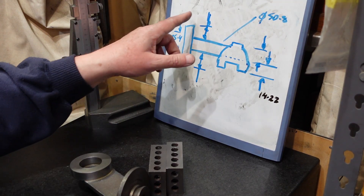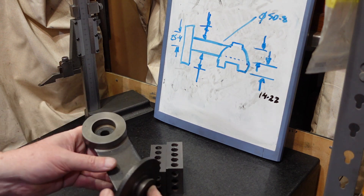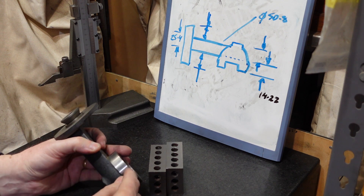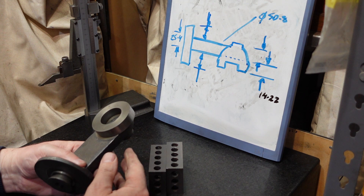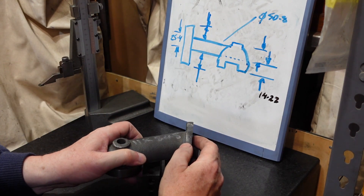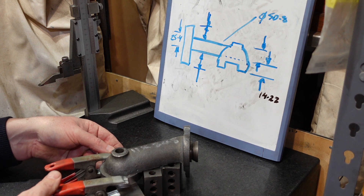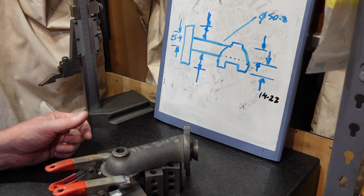One of the first things I need to do is work out a few dimensions, and this is the nice thing about a whiteboard - you can scribble a few things down and then after you finish with it, it doesn't matter. This bracket is not ideal from a measuring point of view because it's got a couple of rough cast surfaces, but it's going to be good enough. What I really want to know is basically how much room have I got to swing things. I've started doing a few things with the calipers but I'm now up to height gauge territory, sitting on a couple of 1-2-3 blocks to measure this bottom flange. I'm going to use a parallel and a couple of cheap spring clips - I've had them since primary school - to measure from there to there, and that'll give me all those dimensions.